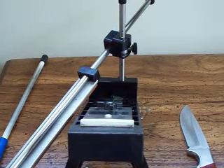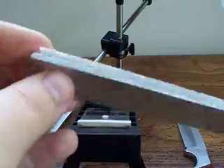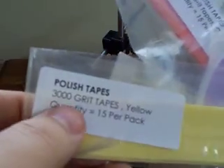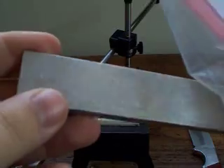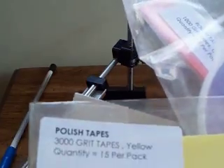Very quickly, I'm going to show you what else comes with this kit. I got the $200 kit. Like I showed before, you do get the paper instructions — tells you everything you need to know. You also get a DVD. I happen to get the polishing tapes. Because I got two different tapes, you get a blank stone — it's the base but it doesn't have a stone attached — and then you get these polishing tapes. I have a 3,000-grit — it's like a sticker, that's all it is. You take the backing off and stick it to the base and use it as if it was a stone. 3,000 grit is really going to put a mirror-polish edge on your knife. And then the other one, the pink, is 1,000 grit. So that's how those work.